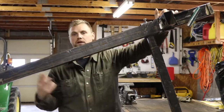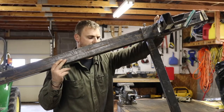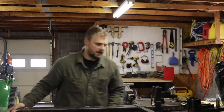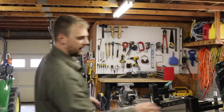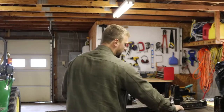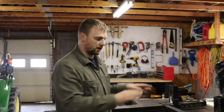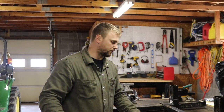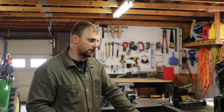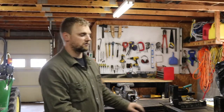The other adjusting screw I don't really have problems with, but it's kind of pointless — I don't adjust the length of this bar ever. It's perfect for moving pallets and logs, so for what we use tractor forks for, there's not really any need to adjust it. What we're going to do today is take out these screws and weld this crossbar in place, so that stays secure and we don't have to worry about it sliding around. I'm not going to put a big continuous bead all the way around because that would affect the integrity of the steel by heating up the metal too much. Also, I want the ability to cut these welds and remove it should I ever need to make some adjustment — I want to keep that capability.